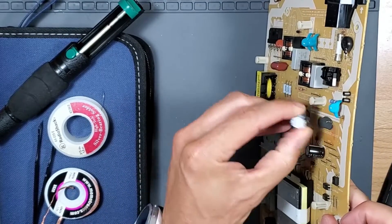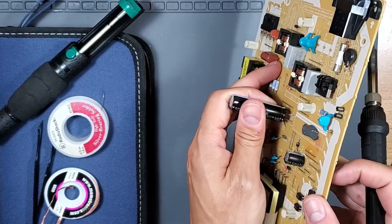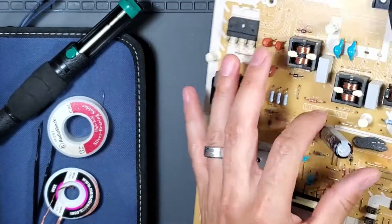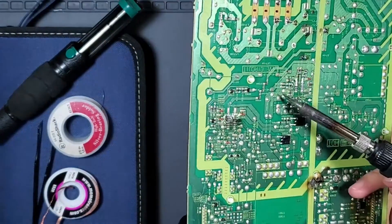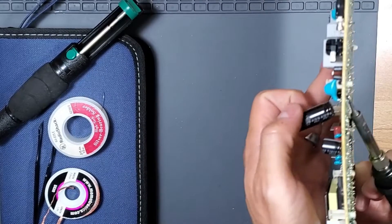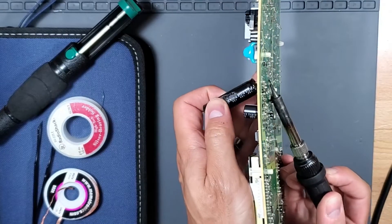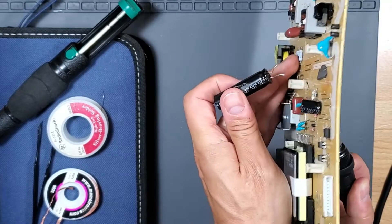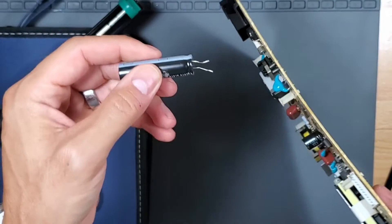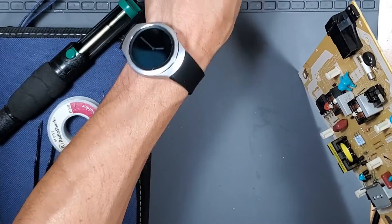To remove this capacitor, you want to free it from the board — there's glue right here, so you just pry it off and wiggle it off. The inexpensive way to remove parts from a power supply, like a blown capacitor, is to heat up the legs from underneath the board. Pull one side out just like that, then heat it up, let it liquefy, and pull the other side out. That is the inexpensive way to remove a capacitor.